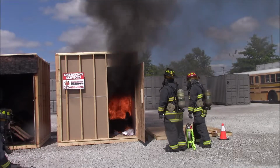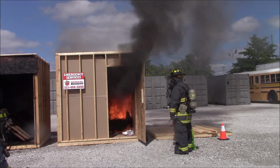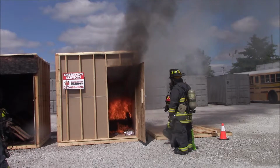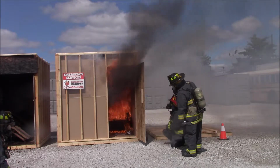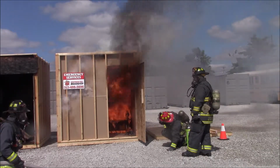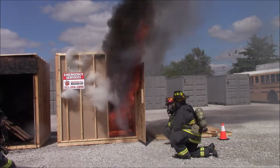We could anticipate that this smoke will reach the right thickness, enter its flammable range, and we start to see now the smoke is becoming flammable. Heat flux. Our heat flux indicator is on fire at the ground. And now we are transitioning to a vent limited fire because fuel is coming out of the compartment unburned and uniting with oxygen outside. The television just popped, it's very exciting.